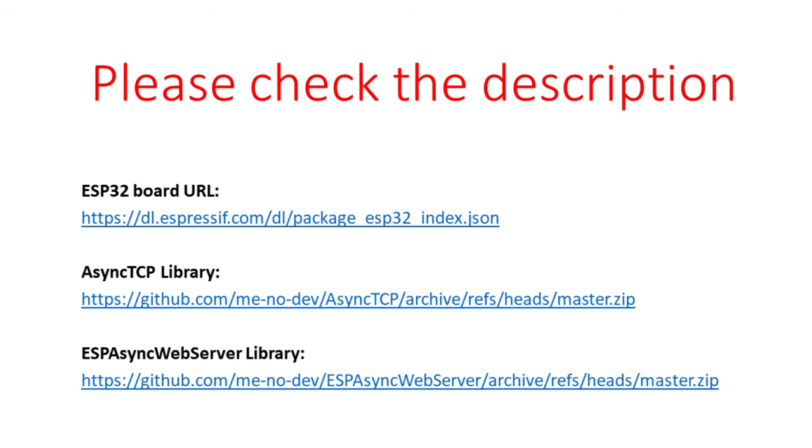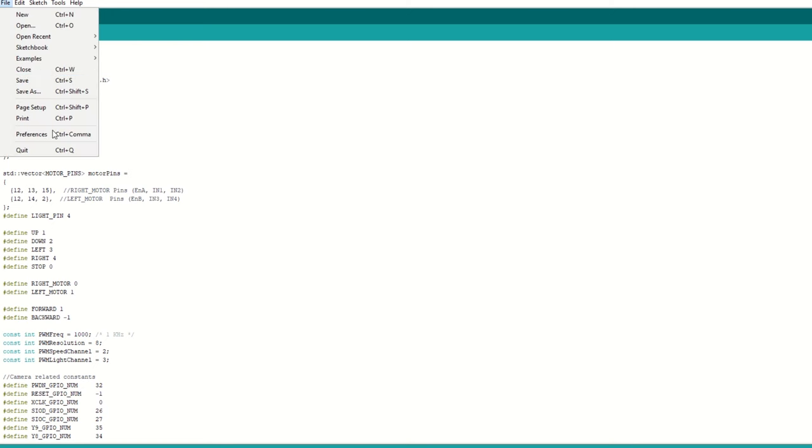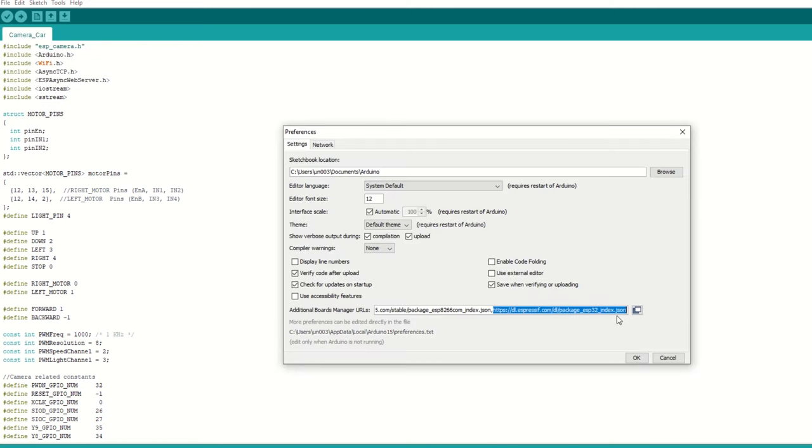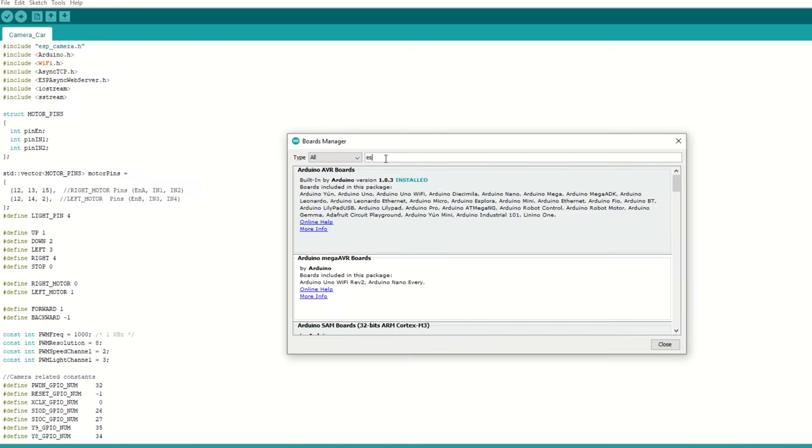Let's take a quick look at the code. First, we need to install the ESP32 board using the Arduino board manager. I have provided the ESP32 board link in the description below. Go to File, Preferences and add the ESP32 board link. Then go to Tools and then Boards Manager and search for ESP32 and install it.